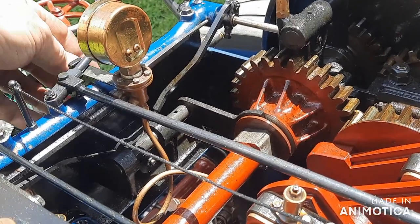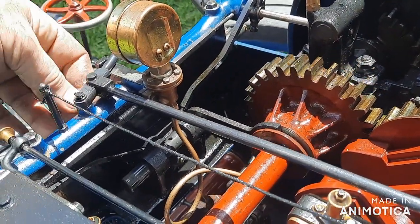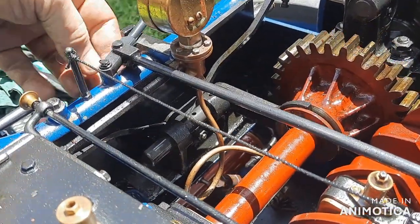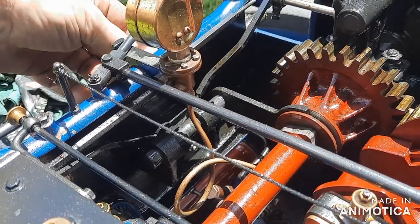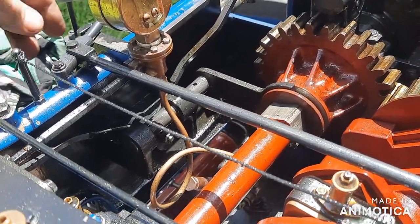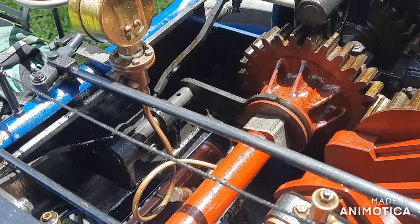In the case of the second gear middle ratio, it's free to move provided both other pins are withdrawn from the block. If they're not — because one of the other gears is engaged — one of those pins will prevent the movement of that gear and you won't be able to engage it at the same time.